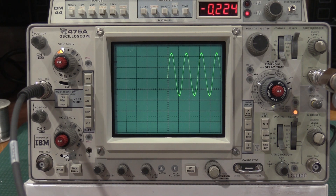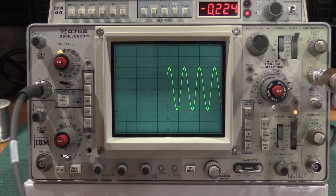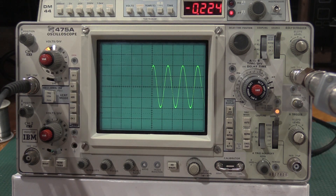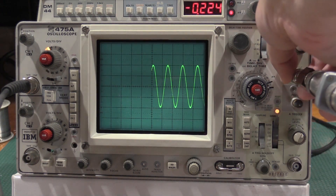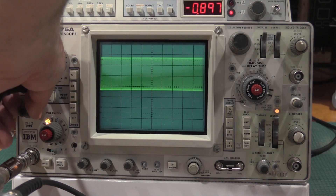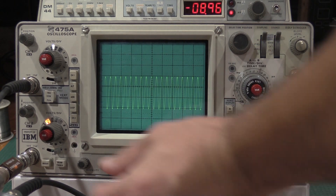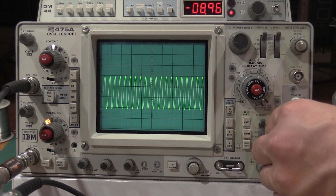The DC centering can come down just a touch. DC centering — R403. This one may not actually have it because I'm not seeing R403 in the schematic; that might be a later addition. It wants us to check internal 40 megahertz triggering. We're triggering fine at 40 megahertz, no problems at all — channel 1 as well, no problems at all.